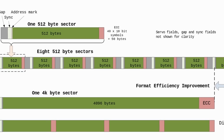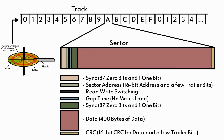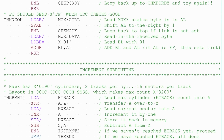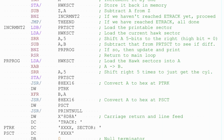Now there's some pretty big hurdles that we gotta overcome here. The EDS PC is naturally 512 bytes per sector, while the Centurion is 400 bytes per sector. So we need to write some software that'll do that transfer that is agnostic of sector sizes. And the Centurion is quite obtuse, so we're gonna have to write that software in raw Centurion assembly, which is something that I think we can do. But the EDS PC side of it is gonna be difficult for me. I've never really spent much time in MS-DOS or writing programs in BASIC or anything else.